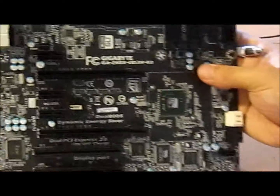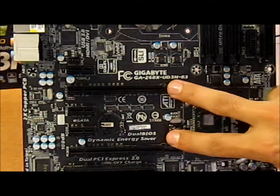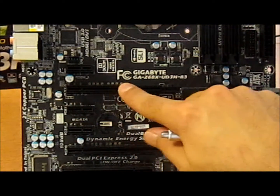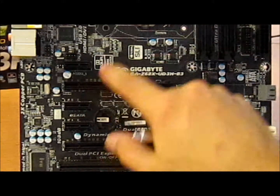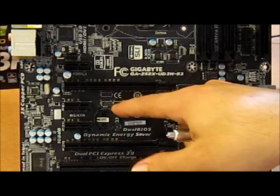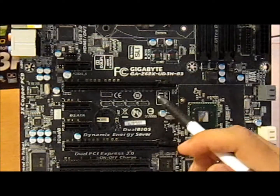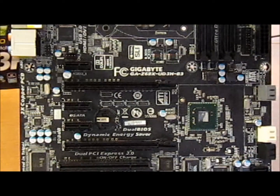Okay, so now let's go to PCI, okay? PCI is directly from the CPU down to these 2 ports, alright? These 2 ports are direct. This is an 8X slot physically, but it has 16X compatibility. 16X slot physically. 8X from the CPU, basically this first half, alright? And the CPU are directly wired. So PCI 3.0 does apply to this with the Ivy Bridge CPU and proper BIOS support. It does apply to the first 8X, but these switches are Gen 2. 4 of them, each switch 2 lanes, back and forth between here and here for SLI 8X 8X or single slot 16X. So basically that second 8X is not PCI 3.0 capable, alright? These 3 are PCI 1X, they're all from the PCH, as the PCH has 8X PCI 2.0 outputs, okay?